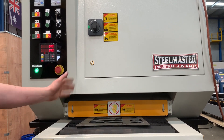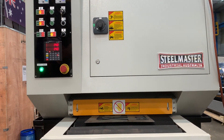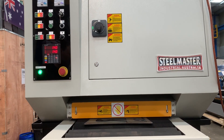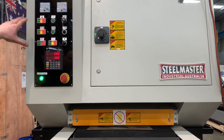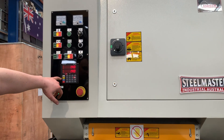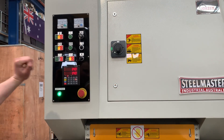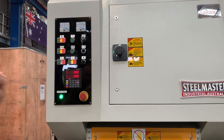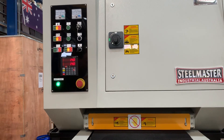Just for the PLC, once you've got some space in the conveyor, you can place them straight on there and they'll feed straight through to the other side where you can recover the parts. So on the control panel, it's very simple to use. You basically just program in the material thickness that you're running and let it position. Then you can set up your conveyor speed with the control on the front and let it run through.